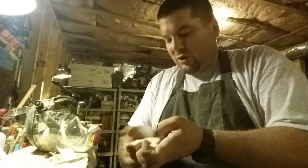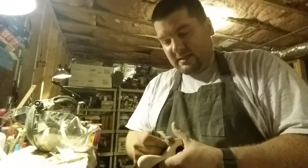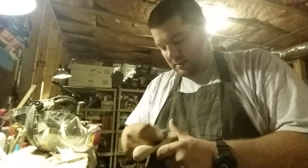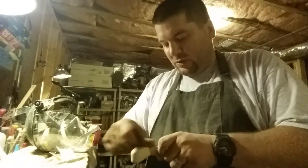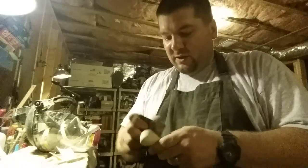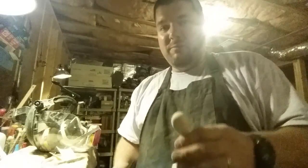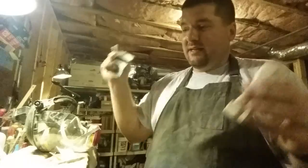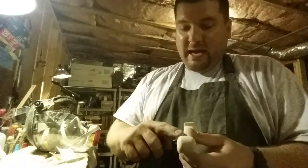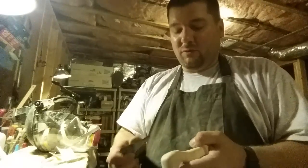If you're spending more than about five minutes hand sanding after you've done the oscillating sander, you're killing yourself. Those of you who have seen my work know what it looks like when I get done. I would spend more time instead of going to the 2,000, 3,000, or 10,000 grit sandpaper — I'd spend more time finding little blemishes and taking them out with the 400 grit.